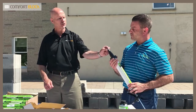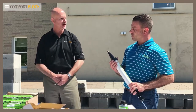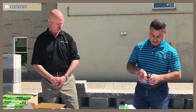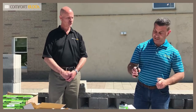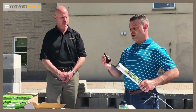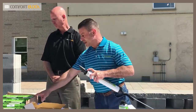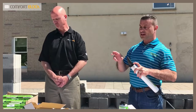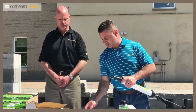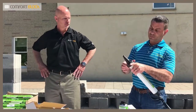Now Randy, how much you cut off at the tip — is that going to determine your bead size? We're always going to work with a half-inch bead. Just take any kind of knife and give yourself a half-inch opening. When you purchase Sticky Stone by the case, the box will actually come with half-inch V-notched nozzles already. But in this case we're going to use one of the ones that comes with the gun, cut it, and secure it with the collar.